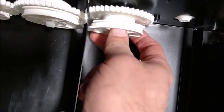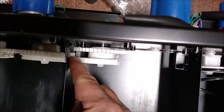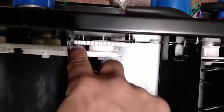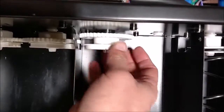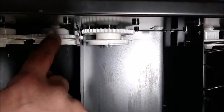Here's the importance of making sure that the shoulders are not the same. If the shoulders are all in the same orientation, you'll see the gears would be meshed up — this is why we have to reverse the orientation of the gear. Now that it's assembled, here's one gear with the shoulder to the rear, and here's the other with the shoulder to the front. This allows them to spin freely; if both were in the same orientation, this row would not work.